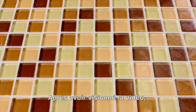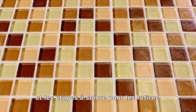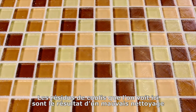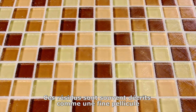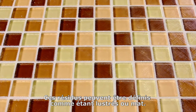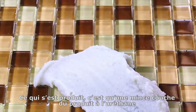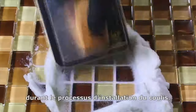After viewing this instructional video you will understand what causes grout haze and the appropriate steps to remove it. The haze seen here is the result of improper cleaning throughout the grout installation process. This haze is sometimes described as a film sitting on the surface of the tile, and can show up as either a shiny or dull film. What has occurred is that a thin layer of the product's urethane binder has been left on the tile surface during the grouting process.